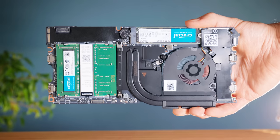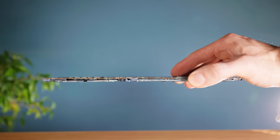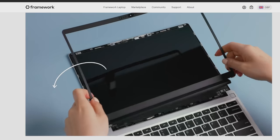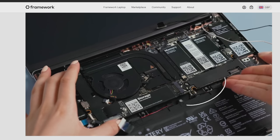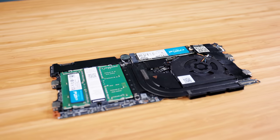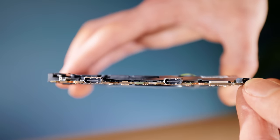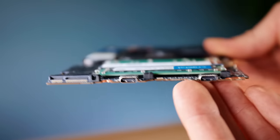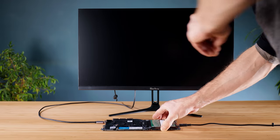Now this actually sounds harder than it really is, because these days we've got solutions such as the Framework mainboard. Believe it or not, this super-compact board is an entire PC system. It's really intended for the Framework laptop — a modular and upgradable laptop system that aims to reduce e-waste — and as such it's been designed to be used independently of the original laptop, so it's perfect to reuse for homebrew projects like this. In terms of I/O it features four USB-C ports, any one of which can be used for powering the system, and they can also each operate as display outputs.